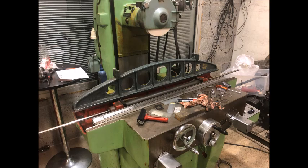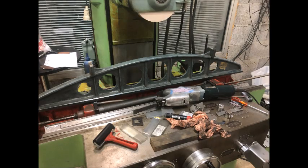This is kind of a stunt project I did, a partial restoration of a Stanko grinder, a Russian machine. As you can see, I have the long camelback here on the saddle, and it proved to be high in the ends, and the table the opposite - high in the middle. The table was also, in addition, very badly pitted, which we took down with the grinder, but really it wasn't worth taking it down altogether. I started off at 9 p.m. and ended somewhere between 3 and 4 a.m., so it was kind of a stunt project. But we managed to get it decently flat and covering all over, so I think on longer pieces now the precision will be better than it was. So that was the scope of the project really, so here it goes.